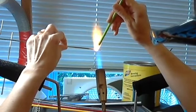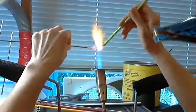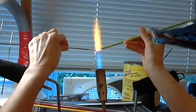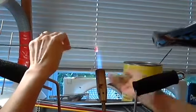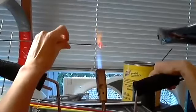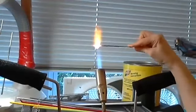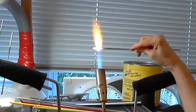And you can see everything's staying in the same place with the exception of that mandrel being wound away from her. And she makes a circle with the glass. But now she's going to add on more. We want to make it bigger. So she does another round. And then she cut the flame off. Now she has to let that glass all melt together. And it's going to go into that spherical shape that it likes so much. And that's another way she switched her hands right over the flame and over the flame as well.